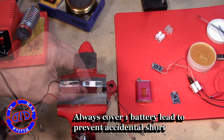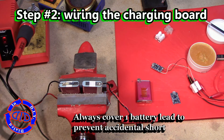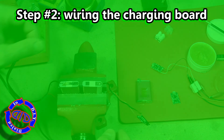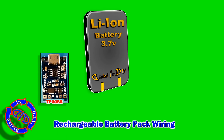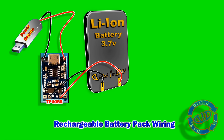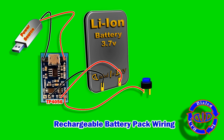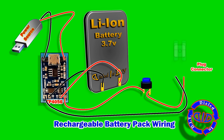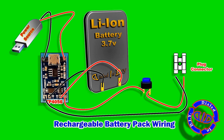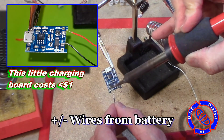To prevent destroying your battery and potentially causing a fire, make sure to take one of the wires that you're connecting to the cell and tape it up so that there's no way it can accidentally short itself out. This little board that we're connecting to the battery does an amazing job — it not only provides the power to charge the battery but it protects it from overcharging and over-discharging. I've had such great success with this piece in multiple projects that I dedicated an entire video just to sharing more information about what it can do, so check out the description below for a link to that video.